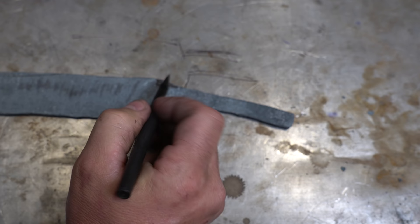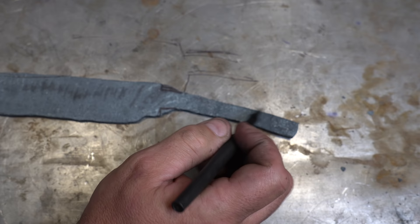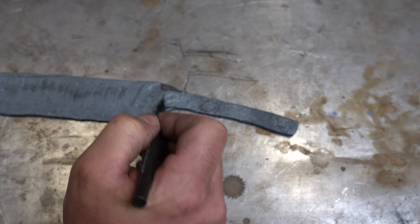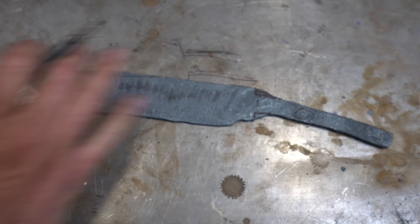Because when your handle goes on, it'll just be a quarter inch above that. That's why I tend to put the tangs pretty close to the top and then more space at the bottom. I always have too much tang here, so I'm going to cut it off a little bit. Just a note on welding a piece — I kept the rebar as part of the tang. There's no problem with welding it here; what you don't want is to weld it at the ricasso because that's a weak spot. But this is going to be in the center of the handle, so there's absolutely no problem. It does not matter if this is mild steel — typically your tang is going to get softened anyway. We need to drill a hole here, so we're going to end up softening this tang anyway.